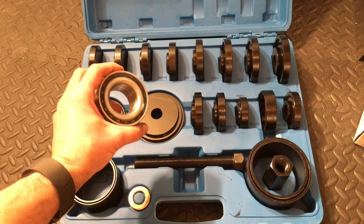The next thing we're going to do is find an adapter that's going to fit right around this edge that's still exposed from the bearing, that can push through. So I'm looking here — this one might fit, but no, that's just a little too big. So let's go with this one. That one fits in; it catches it enough that I think it'll push it through.